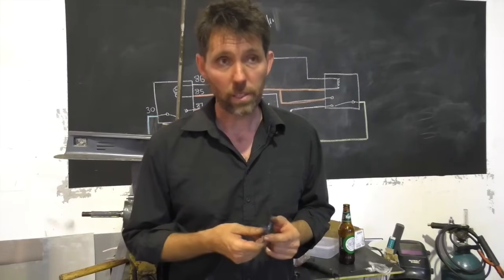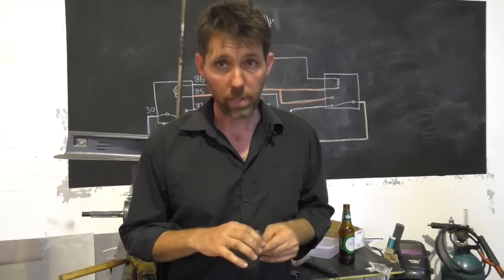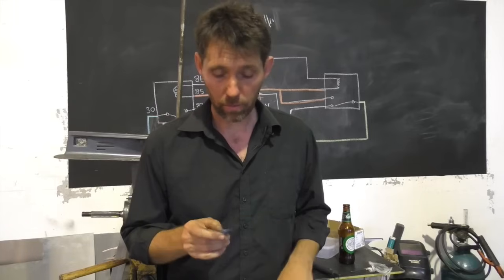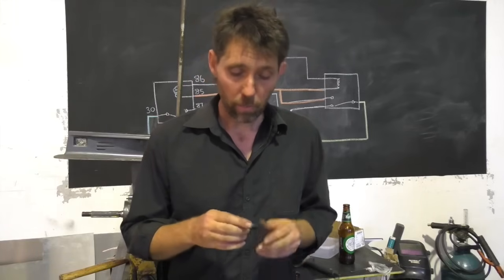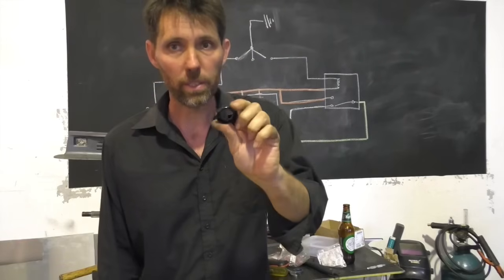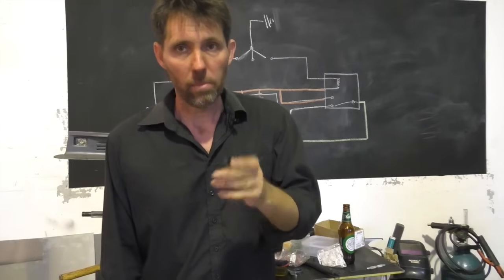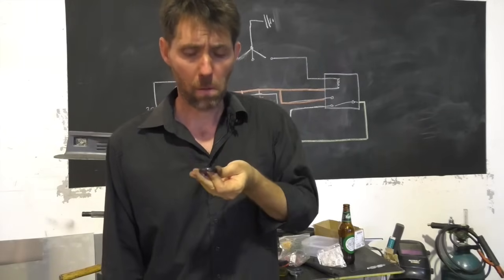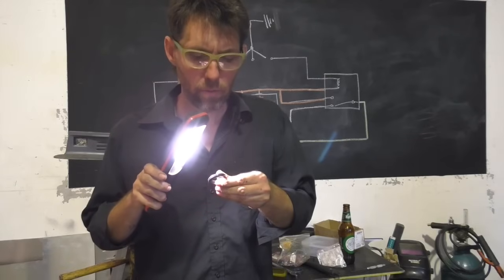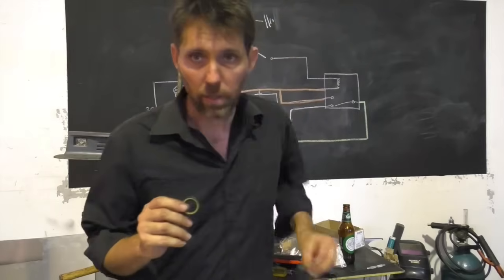So this next thing I think is actually quite a cool tip. I was told this week by a guy called John at North Shore Bearings, Hornsby, Waitara way, if ever you're looking for a good place to get bearings, oil seals, all kind of things. And he was the guy that put me on to these oil seals. So I gave him this original Yamaha seal and said, can you give me more like this? He measured it up, they're actually written on it. It's got measurements. 22, 36, 6 is what it is.